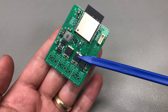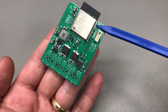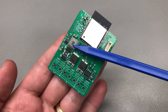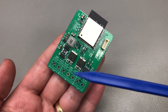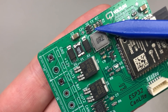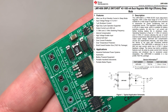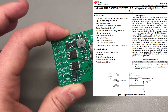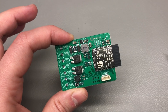It's got a couple of high side switches, the CAN interface, a powerful processor with Wi-Fi capability, and an automotive rated DC to DC converter to allow the user to power this from a car 12V system or even a 24V system. The DC to DC converter chip I'm using is the Texas Instruments LMR14006, and I've been pretty happy with TI converters over the years because they generally perform really well and have good documentation and design resources available.